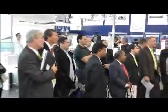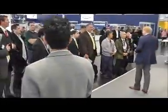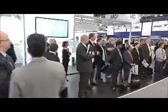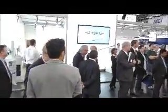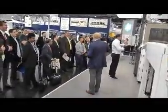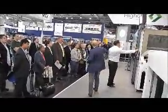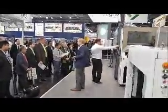The card continues through the machine, and here we have the cutting station. And in the cutting station there's 3 high power lasers, 3 400-watt lasers with a scanning device we've developed and our own optics. So the cards cut with precision, speed and accuracy. And of course you'll see the quality in a moment. So there's no stop-start, it continues and then comes out into the stacker at the end of the machine.